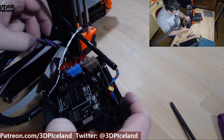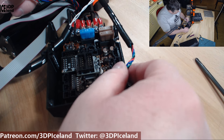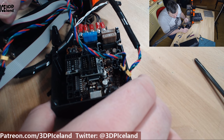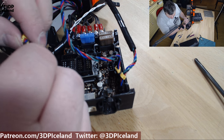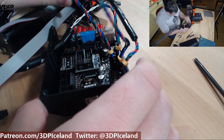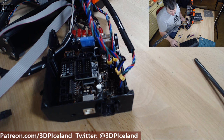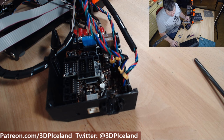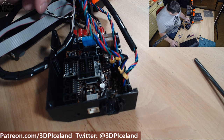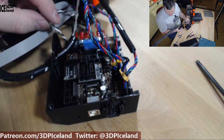The next thing to connect is the motors. I already connected the X-axis motor. The next one is the Y-axis motor, and then there are two Z-axis connectors — it doesn't matter which is which as it's just a parallel connection, so there's no Z-left or Z-right indicator on the board. Next they want you to connect the black and white cable from the power supply — that is the power panic connector. Connect that one in the corner. And then the cable from the bed thermistor is connected over here.